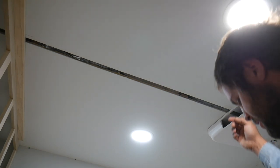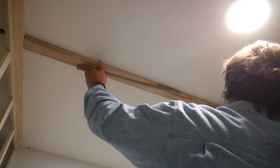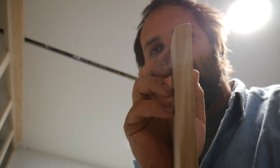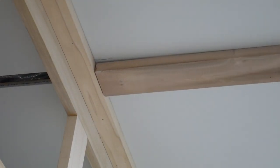So I'll put the little air handler deal back on the air conditioner, and I've got this piece that's going to run down the middle of the room. There wasn't a real good way to come into that AC unit — I just sort of cut a weird little half-straight half-angle joint; I think it'll work. The ceiling is sort of humped, so when I pull this board flush there's actually a small gap. I'm going to run another piece of trim on the inside to alleviate this — I'm going to take a couple of shims and shim this out ever so slightly. Also this board is thinner than the rest of them for some reason.